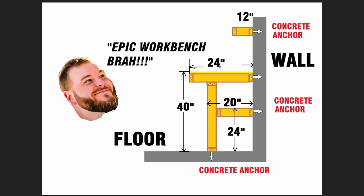For those new to the channel, I always break down the workbench in a 2D fashion to give a basic structural idea of what we're doing. It's a 24-inch workbench top, made efficiently by ripping a 4-foot by 8-foot sheet of plywood economically. We're going to do a 40-inch workbench top height for Mike — a really good average height. By cutting your stud length for vertical structure, you can drive that workbench height to whatever you desire. Mike's working with all concrete, so we'll use concrete anchors or concrete nails.